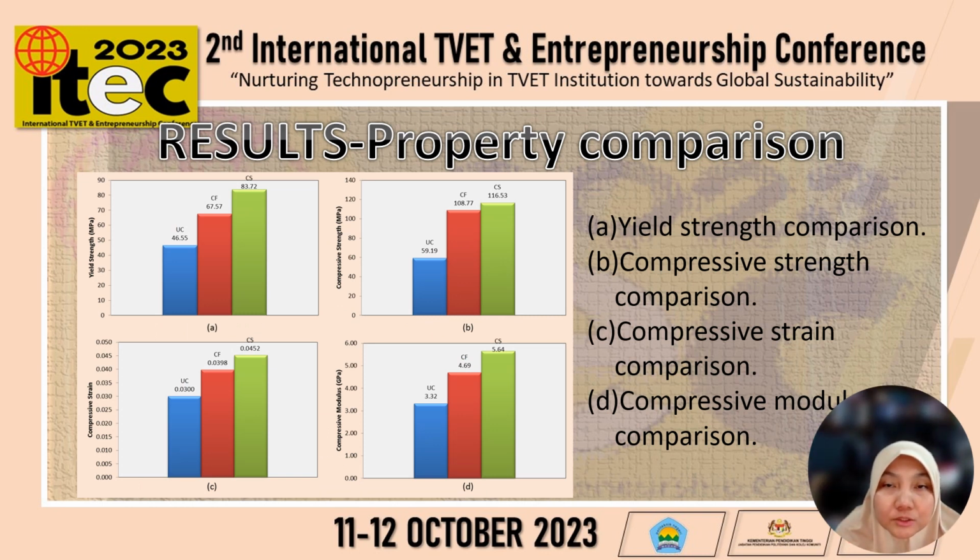The bar chart here shows comparison of mechanical properties among all test samples. Figure A shows yield strength comparison, with UC sample 46.55 MPa, CF sample 67.57 MPa, and CS sample 83.72 MPa. Figure B shows compressive strength comparison: UC sample 59.19 MPa, CF sample 108.77 MPa, and CS sample 116.53 MPa.